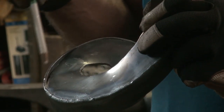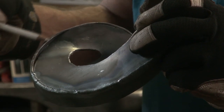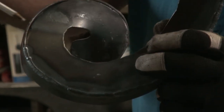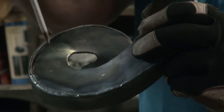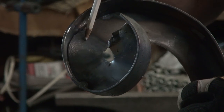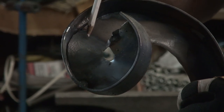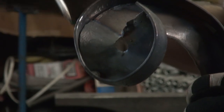This is the little area right here that I want to work on. You can see here's my side - this is the outside edge, and here's the bottom, and I've got this little dip right here. So I can go to the inside, here's the raised edge, here's the bump I want to work on, and I can just put my anvil right underneath it, come in with my hammer, and take that thing down.